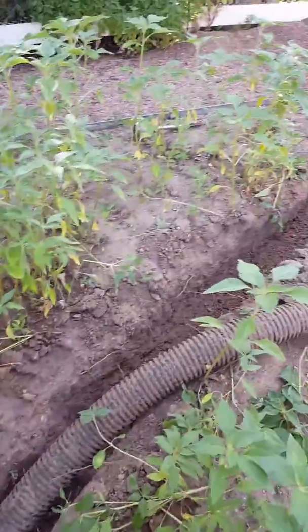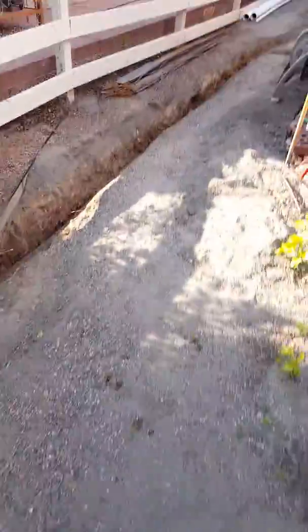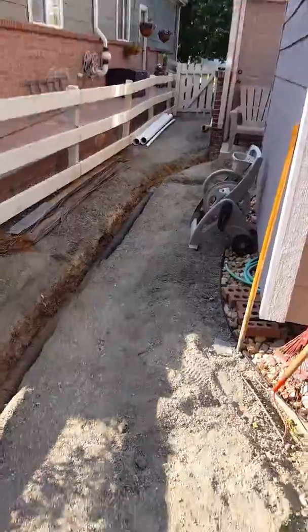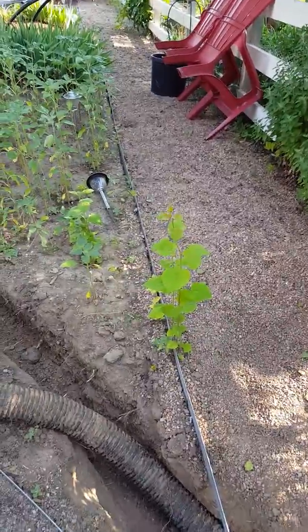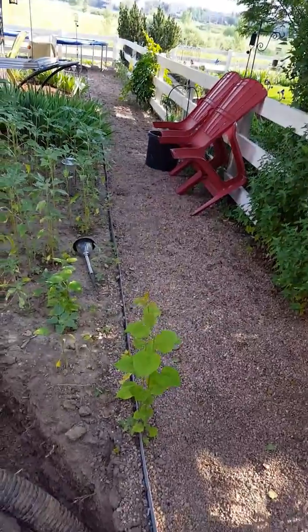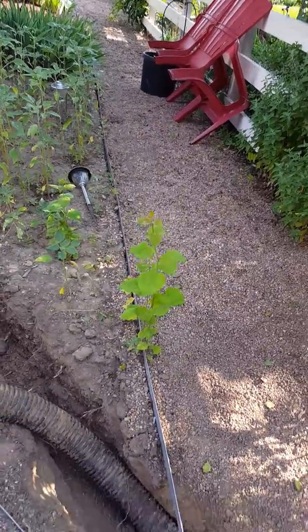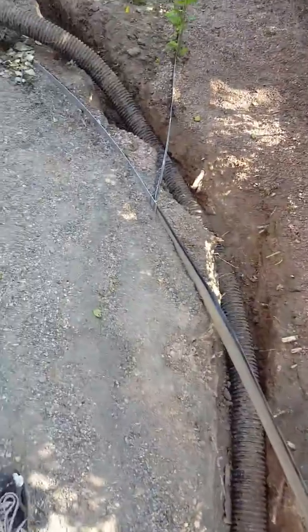The new line is going to use four-inch white PVC — you can see it right there — and it's going to go along this dog run area, then expel with a pop-up past the tree right there. So if that sump pump ever kicks on, it will be blowing the water way beyond the foundation.